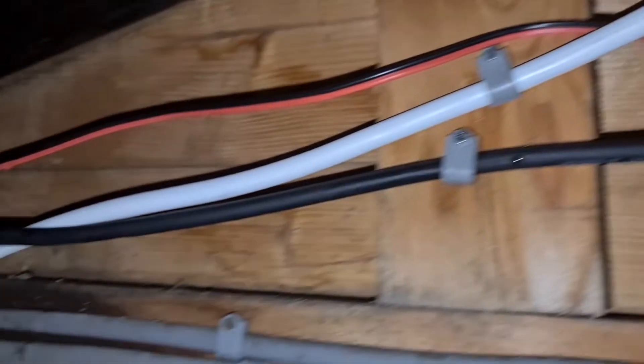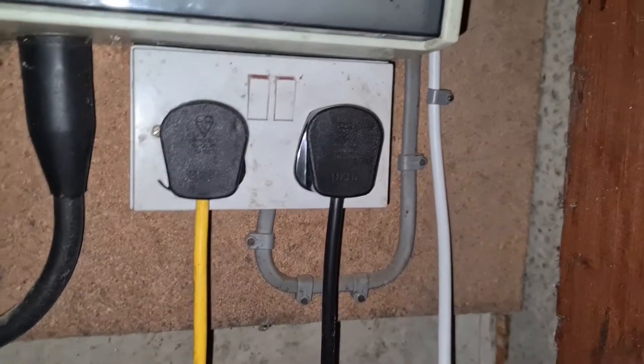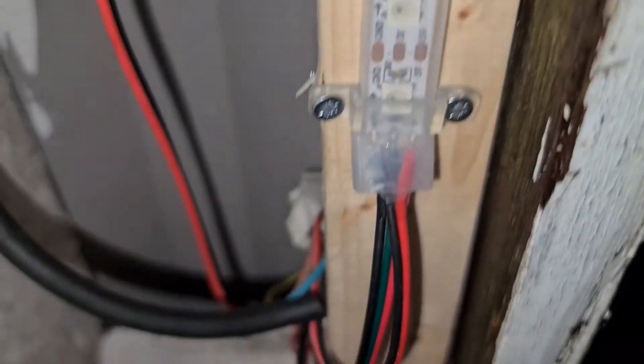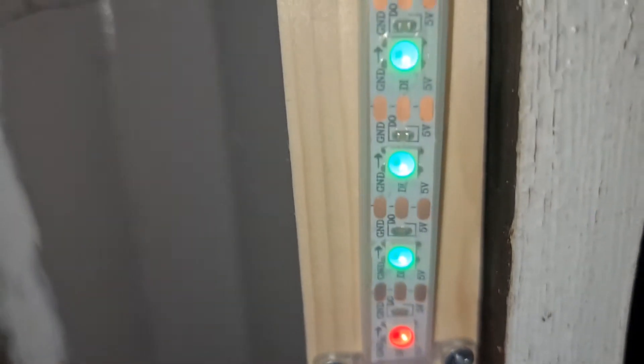Different wires - the white one's going to the plug for the power, back to the lunch box. Inside the lunch box you can see the metal unit - that's the power supply, breadboard with the NodeMCU on, and the cabling. You can just see the WAGO clips there connecting to the other wires. On the outside the wires come through there, just clip them up with some more WAGO clips behind there, all taped up for now. And you can see the LED strip mounted to that wooden piece, running all the way across, with some little mounting clips just to hold the LED strip in place. Fully waterproof LED strip, and just some of the effects for the LED strip.